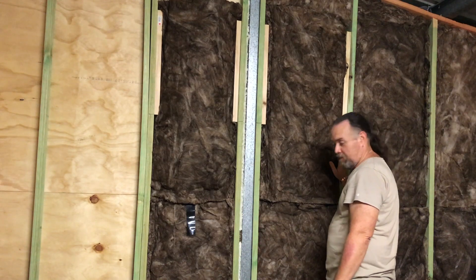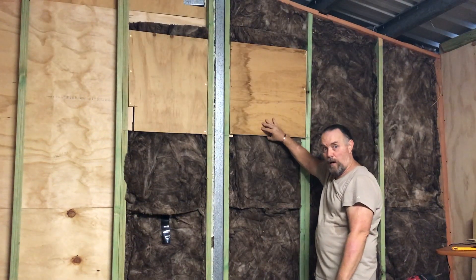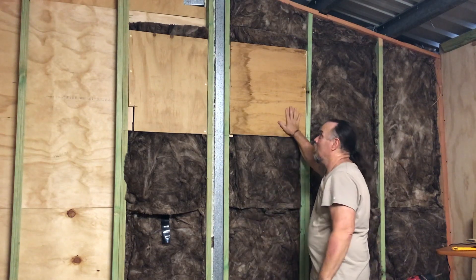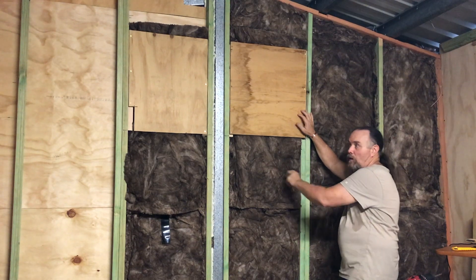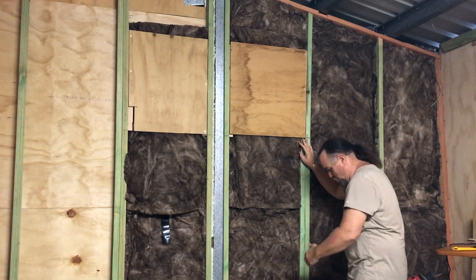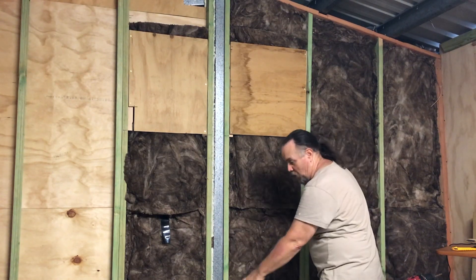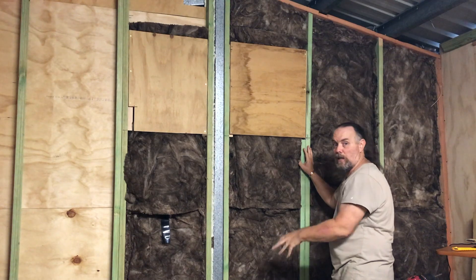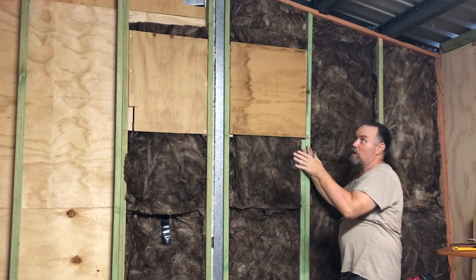The 12mm plates have been put in — they don't have to be screwed down really tight. They're only being held in place for now because once you sink a screw from the other side they'll be stuck to the back of the board anyway, so I've only put three screws to keep them in place. I've had to add an extra inner stud on each side because the join is going to be slightly offset, so I've got to make that all nice and level. There's a bit at the bottom of the stud sticking out farther that I'll need to chisel off to smooth the join. I've still got to drill a couple of holes to get the cabling through, then I'll put a sheet on each side — they'll be cut just a little bit because they're slightly higher than the outer wall.